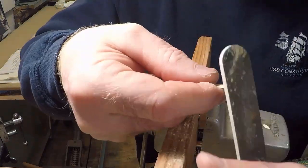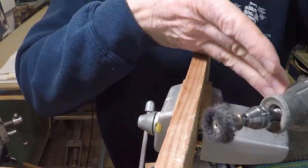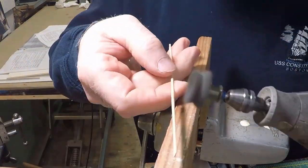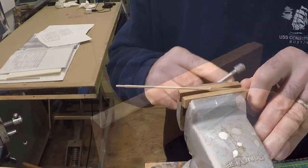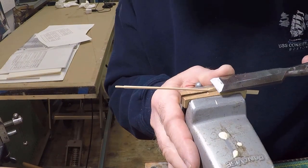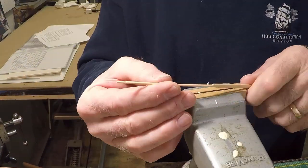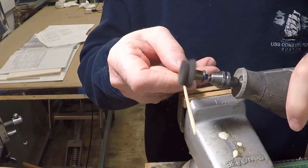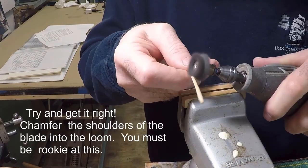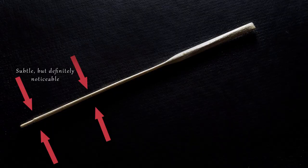It might not be a bad idea to round over the corners of the end of the blade just a hair — you don't want them round, you want them square, but you want the edges broken. After that, you can take a buffing wheel to it, remove all the excess fur, and put a nice finish on it. The last thing you need to do is chamfer in the shoulders of the loom into the handle — they have to look smooth and contiguous. And once you've got that done, there you've got an oar.